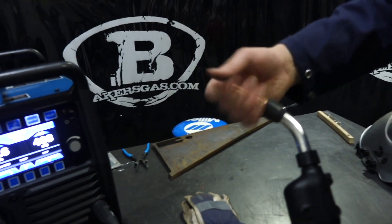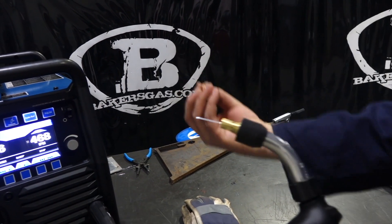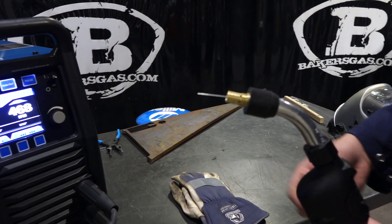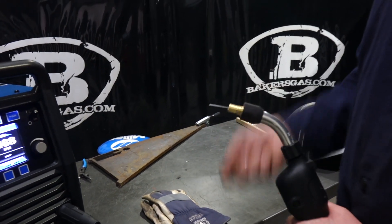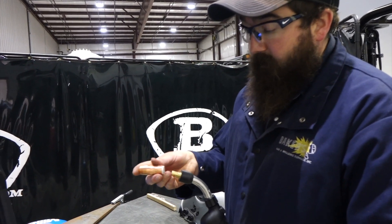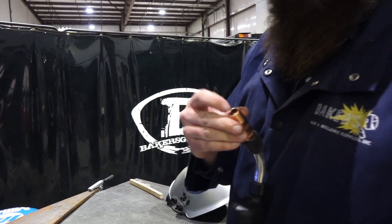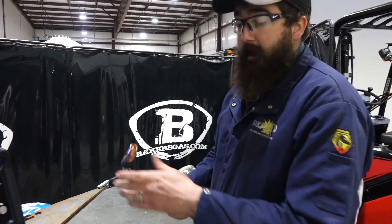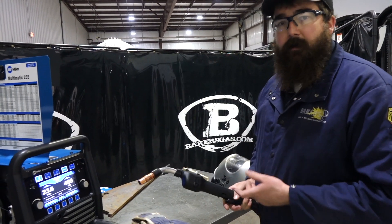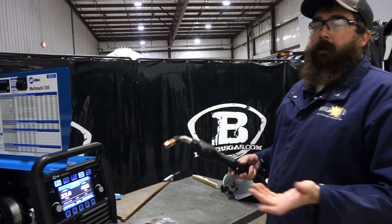This gun takes your slim or tapered consumables — the centerfire nozzle and centerfire tip. You can also get quick-twist consumables by swapping out your diffuser, which is a standard Bernard D-1 or DS-1. The nozzle is the NS slim series, and then your regular T-035 contact tip. If you already have a Bernard setup, you can use the same consumables in this gun as you do in your other Bernard guns — you don't have to go out and buy new consumables.